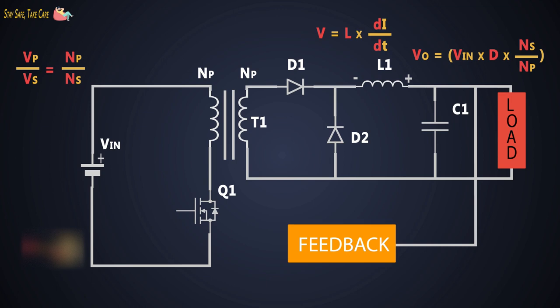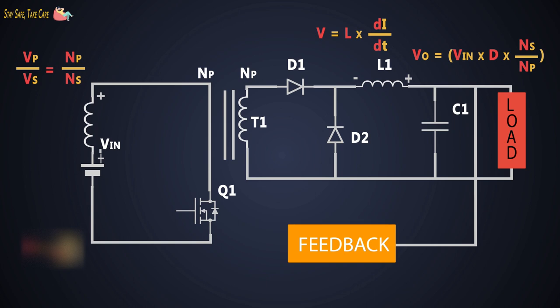But in the real world, these windings act as inductors. When Q1 is turned off in the second mode of operation, the current is interrupted, so according to V = L·di/dt, when the current changes in a short period of time, the voltage across the inductor induces. This process repeats after every cycle, and in a few cycles the transformer will saturate. This voltage is so large that, as you can see in the circuit diagram, it gets added to the input voltage and the voltage across the drain and source of the MOSFET increases immensely, which will eventually break down the MOSFET.